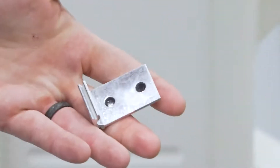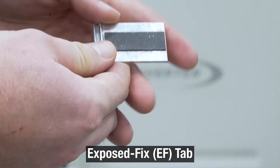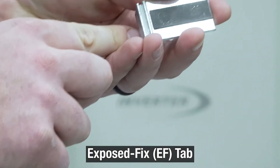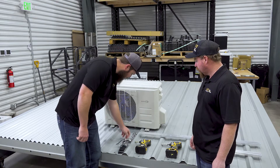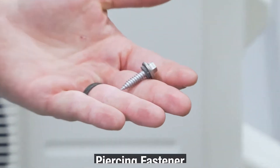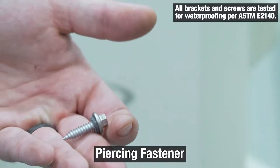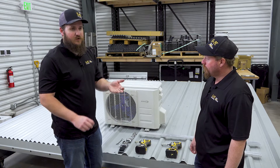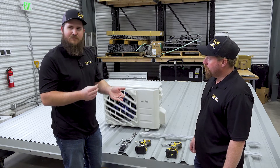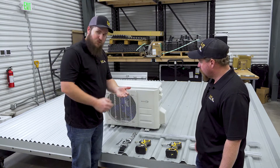We're going to have our S5 EF tab — EF stands for exposed fasten — which has an EPDM sealant on the back to keep out any water intrusion. It's going to be installed with our S5 stainless cap EPDM washer self-piercing fastener, so it's going to pierce that panel, create a really nice tapped hole, resist pull-out very well, while preventing water intrusion.